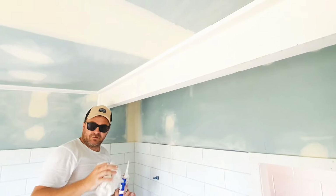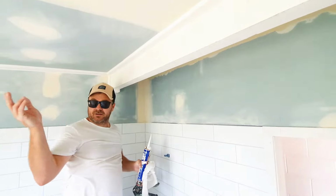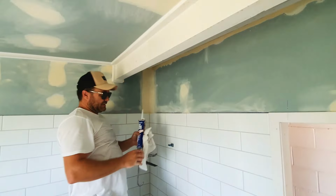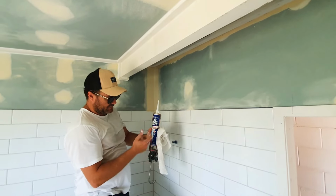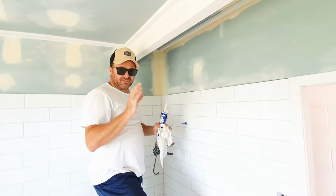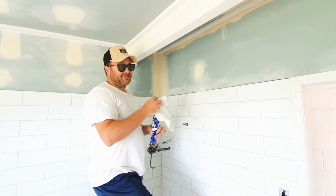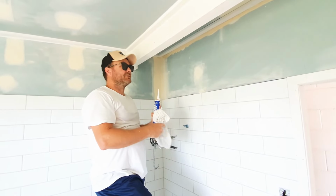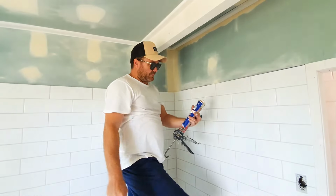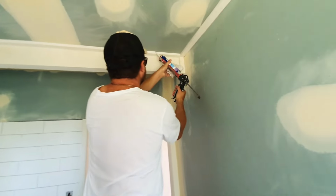And then I've got my Graco handheld spray, and what I might just do is spray the undercoat around the outside so I'm not disturbing anything. This is quick dry, fast dry, no more gaps. So hopefully it doesn't crack, because if you paint over gaps too soon, it leaves a hairline crack. Normally you need to leave it overnight, or else hairline cracks, nothing we can do about it. But this stuff is pretty good with that, so we'll leave it a few hours and then paint it.